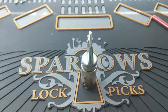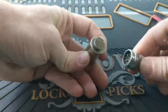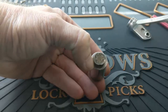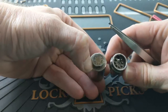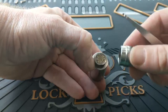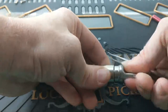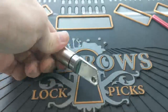Here's another way of doing high security, a little different. This is a T-handle plug lock — it's a van lock, basically just a tubular lock that is very difficult to tension. The face is basically flat and the key has little pins that stick out. These aren't super high security and the plug is all brass — the pins are steel — but the plug being brass makes drilling a little easier. These are usually used in vending machines, anything involving cash, gas pumps, things like that.